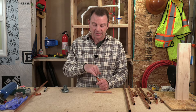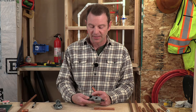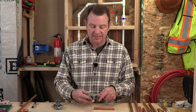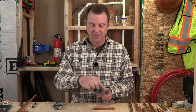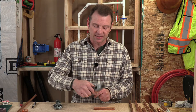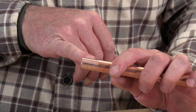So we're done with the deburring. This end is now prepped for our sweat process, but there's one other thing we need to do to the end of this pipe — polish it. I'll use my brush tool. This will polish the ends; I have my half-inch and three-quarter sizes. This is for the outside of the pipe, and then there are other ends for the fitting. This slides on the pipe and spins around a few times — there are little wire bristles inside, basically a wire brush — and when you're done it has created a polished surface on the end of the pipe.